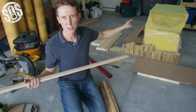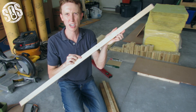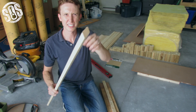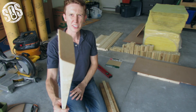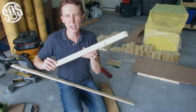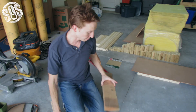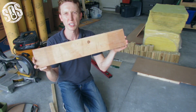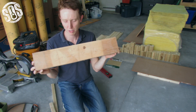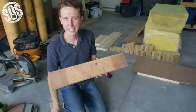The panels that I've got are 2 feet by 4 feet by 2 inches, so you want to make sure that the inside of your frame is 48 inches. I've cut the ends at a 45-degree angle there — they create a perfect corner. For the 24-inch, I've got a 24-inch interior. I've also cut myself a 24-inch square guide, and this is going to serve as a placeholder for my acoustic panels as I'm building the frames.